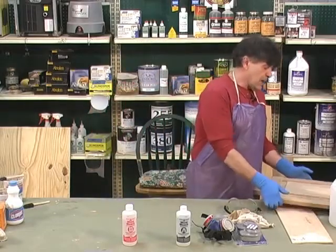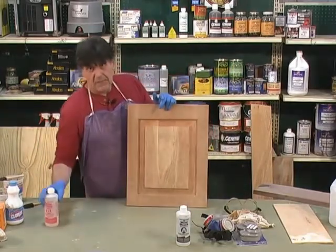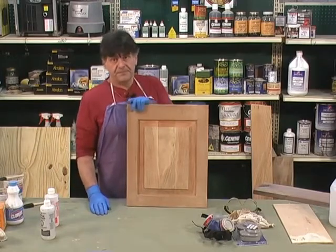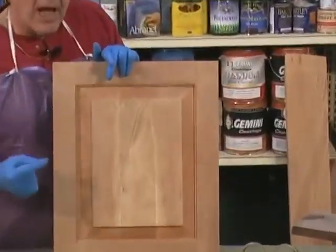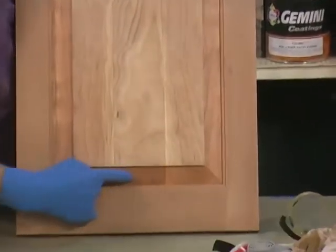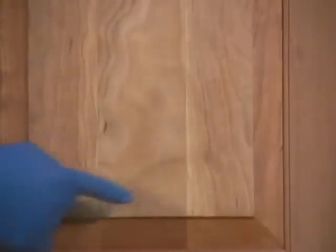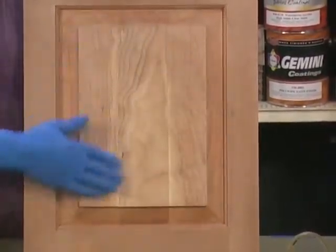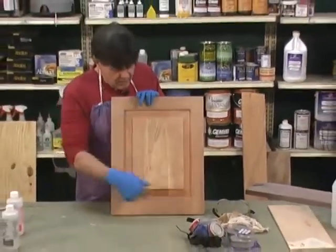Now, if you remember back when we were talking again, in the sanding DVD, we pulled out this raised panel. And I told you that no finisher would ever glue up those 3 boards. And I was right. But to get an equal balance, Billy, I want you to get in right here on this bottom. You can see that board right there in the bottom. And if you look from here up, if you remember, there was a great big red spot. By lightening this, I brought this panel into a basically an even color. And I could have hit it again and got it completely even. Much lighter, but equal color.